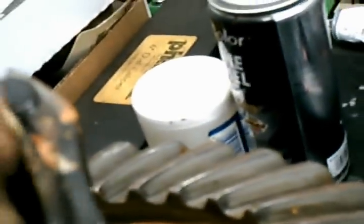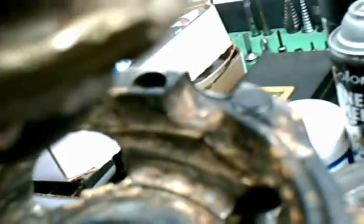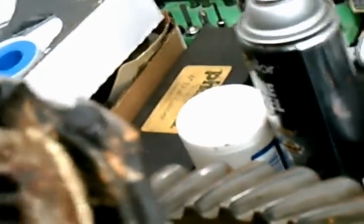Here's what popped 32 years ago. This is another gear just like I showed on the other side — it had teeth in it and the little spider gears would have turned against it. It fits down in here like so. They brazed it just the same, but this braze popped loose. Without the other little spiders, that would have prevented it from pulling at all. And that would have been the right side — there's why they thought they had a broke axle.